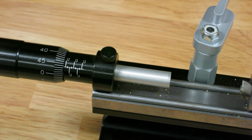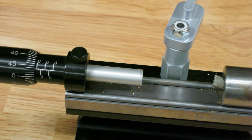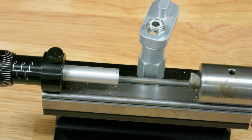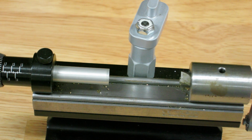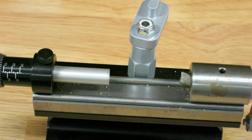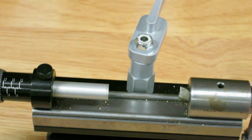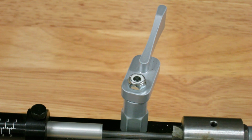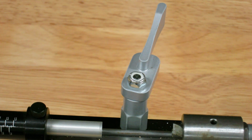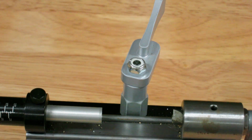get a firm cut. As you get to the center, you'll notice the two steel rails at the bottom which allow the case holder to self-center and also to have a good solid mount. In the middle up top is the aluminum shark fin that Sinclair adds to their version. This basically allows you to set the tension with which the case holder is held in place.